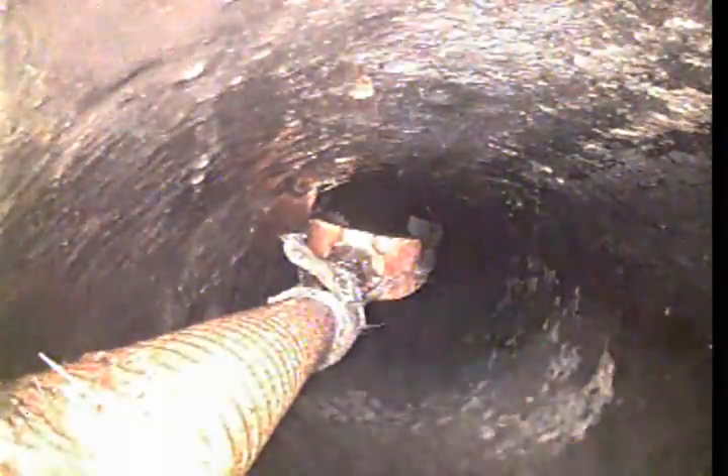There you see the ovaling. It's mostly for our records and the excavation company. Here you see some major ovaling. This is a good spot where you can tell that the pipe is getting thinner and thinner. The ground is settling over the pipe and it's ovaling. Eventually, that will probably be the point that collapses. The pipe doesn't look too bad overall — it has certain spots.